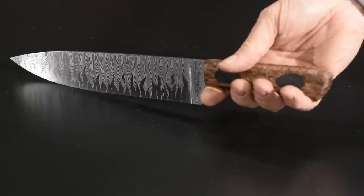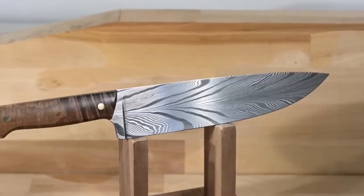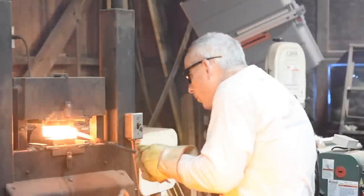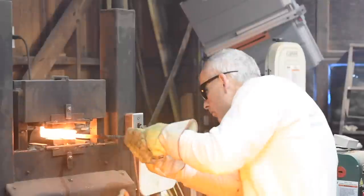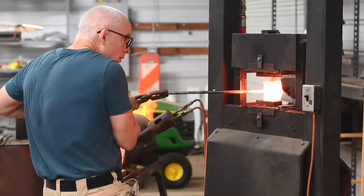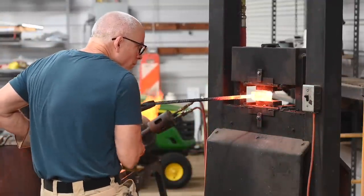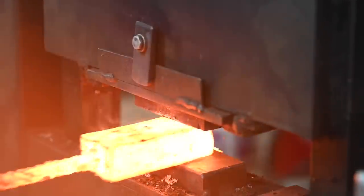So what are hammers good for? If you're doing production forging, a powerful hammer can be a beautiful thing. But let's get back to what presses are good for. The first thing that presses are just indispensable for is making Damascus steel. Setting a weld on a big stack of steel works super easily with the nice big flat surface of a flatting die. You can do it with a hand hammer, but a press is much more consistent and helps you get better welds. Just slide the billet in, a couple gentle bumps, and inside of a second or two, a bunch of individual pieces of metal have been converted almost as if by magic into a single block of steel.